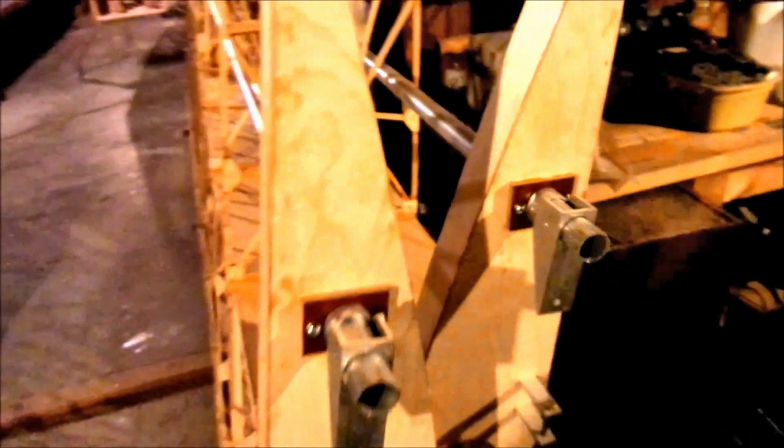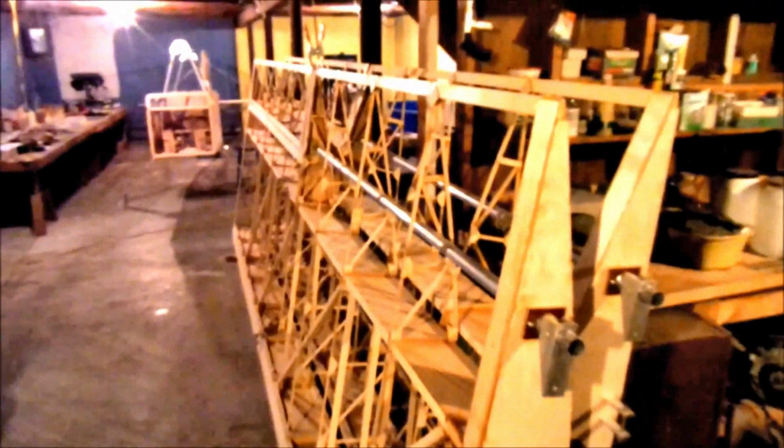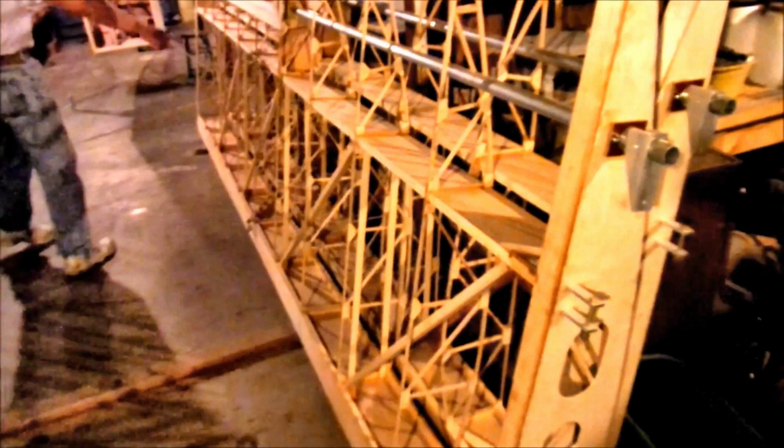Yeah, this wing is very, very similar to the Mini Max. Very similar to Mini Max and Legal Eagle type wings, or rag wing wings. Yeah. Mini Max has one less compression member for the ultralight legal version. Oh, gotcha. You got three versus this has four. Oh, the diagonals? Yeah. Diagonals, yeah, I see. So, very similar construction. So you have a tried and true design.